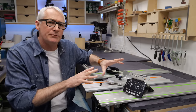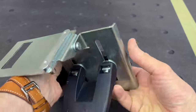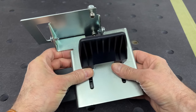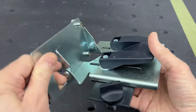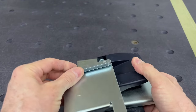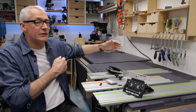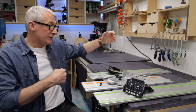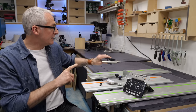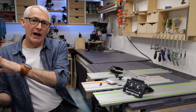So that's your three commercial hinge systems. Let's do a quick recap. The Festool OEM hinge system: pressed steel and plastic, not exactly a premium product, only really works with Festool's own rails and extrusion. On the other hand, it is available as a spare part, so bizarrely it is the least costly of the three at around £110 for the front and rear set. It is the only commercial hinge you can purchase as separate front and rears, so you could just buy the hinge part and make your own front rail support if you're on a tight budget.